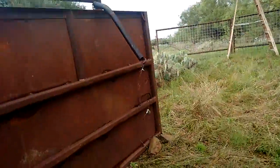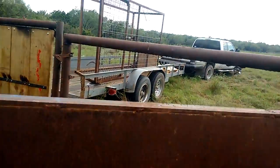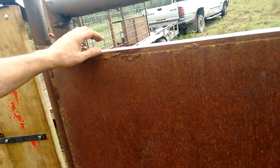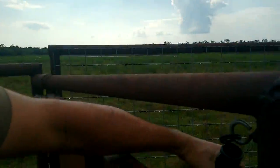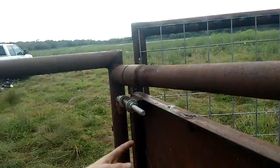This is the gate — it's the same one I used on my other corral trap. That locks it; it's pretty heavy. This spring here is a garage door spring. The cable goes through a pulley and hooks on it, and that's what slams it shut.